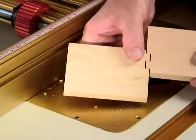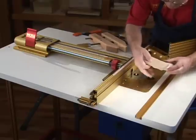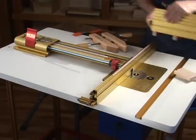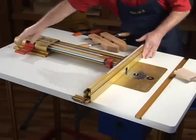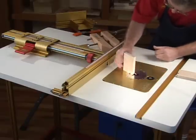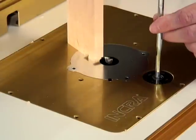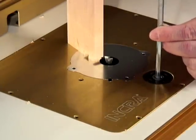If you pull the two dovetails one against the other, the gap that forms is equal to the amount you need to raise the cutter to tighten the joint. If the boards are too tight or won't fit at all, you need to lower the bit to loosen the joint. Just remember, heighten to tighten, lower to loosen. In either case, adjust your depth of cut accordingly, then repeat the test cuts on a fresh corner of the boards.